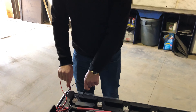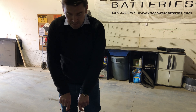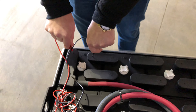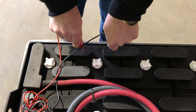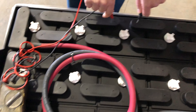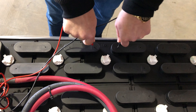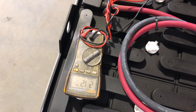So we're going to start here with cell number one. My colleague Robert is going to be writing down the cell voltages to facilitate it. Cell number one: 2.11. Cell number two: 2.12. Sometimes you might not get a perfect contact — you might have to wiggle the probes a little bit so that you get a firm contact until the voltage reading actually stabilizes. So 2.12.